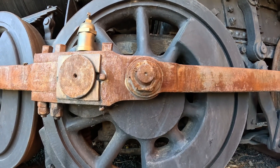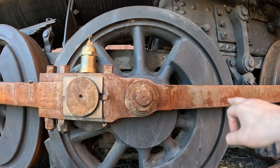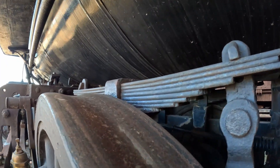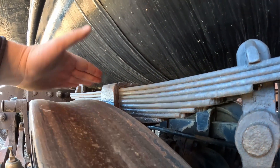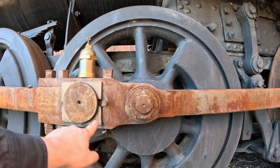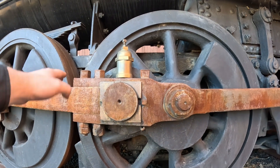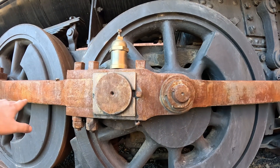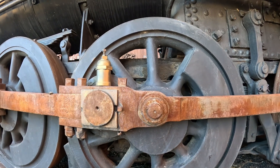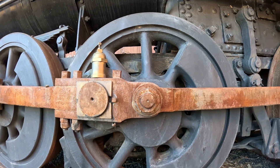I wanted to make this video to talk about the crank versus the wheel size, because this is a confusing little detail in the tractive effort equation that a lot of people seem to forget about. Take a look real close at 191's drivers here. You can see we have the center of the driver with its hub and then spokes coming off, and you can see where the tire is — 191's tires look like they've not been turned in quite an eon; very hollow tread. But the interesting thing to note is that the crank is all the way out here — more than halfway out to the rim of the wheel. So the crank is super far out, meaning we can apply that much torque from the center to the crank on this wheel as the rods go around. The further out we make the crank relative to the outside of the wheel, the more force we can apply.